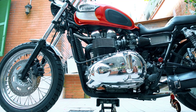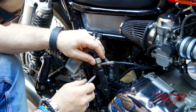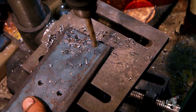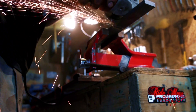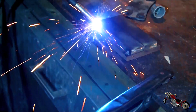Being this quite an elaborate project I've summoned the great Polsky Rage — he's great at welding and metal shaping and his skills will be extremely valuable on this project. While I get to work removing the brake pump that will need to relocate along with the lever, Polsky Rage begins evaluating how to fabricate the plate that will support the entire structure. After getting all the necessary measures he starts drilling the mounting holes on the drill press, starting with a smaller drill bit and increasing the size until he reaches the desired diameter. We then realized we needed to be a little bit further out not to interfere with the frame down tubes, so a piece of 10mm thick stock is used as a spacer and a couple of spot welds ensure it stays in place.